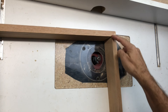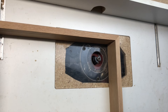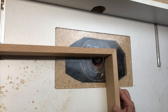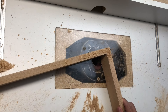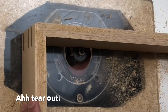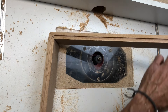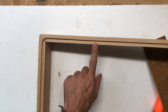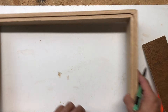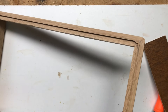Let's route an edge around there to drop the glass into. Of course we want it on the other side because this is going to be the lid. I do get some tear-out - is that a function of something I'm doing wrong or just the wood? For the woodworkers, any thoughts? I had some splintering here, so to solve that I'm just going to put a light pass with the sander around the edge and go around it really carefully.